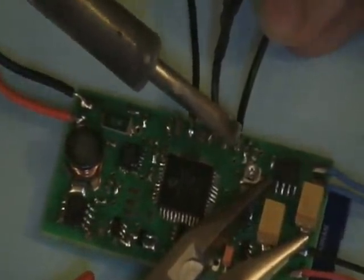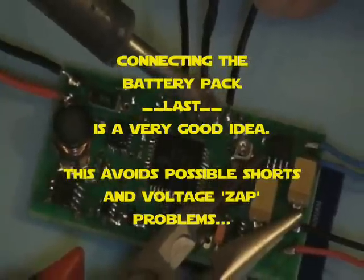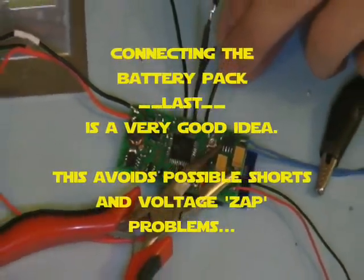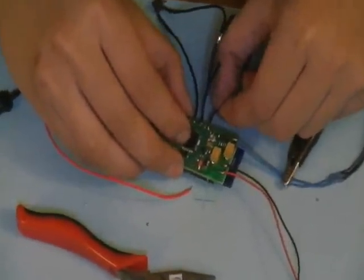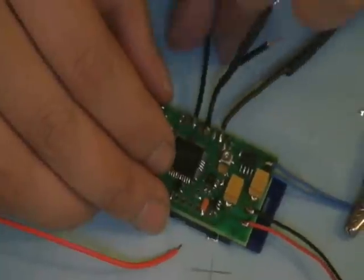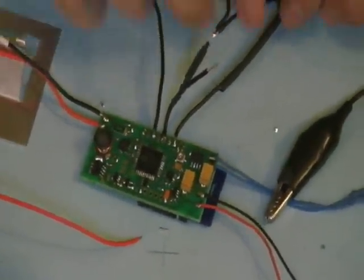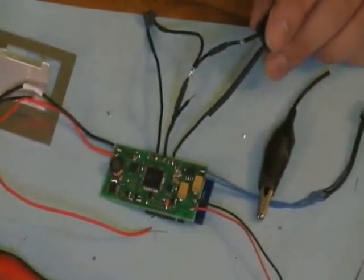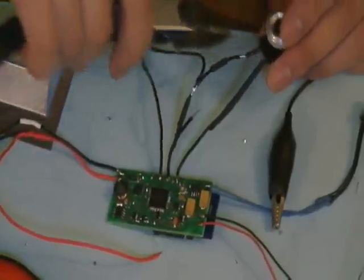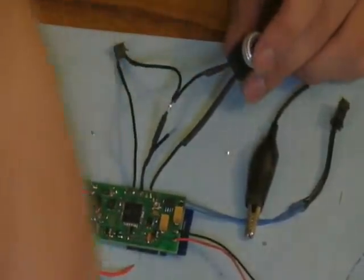What we're doing to the board here is perfectly safe because there isn't even a battery involved right now. It's recommended to leave it so the battery leads essentially go nowhere — use a quick disconnect, so the board is completely isolated. There's no voltage and you can't short the board out and destroy the component. It's good to do the batteries last. In terms of electrostatic charges, just touch some metal before you go in; you should be good unless you're running around wiping your shoes on the carpet.